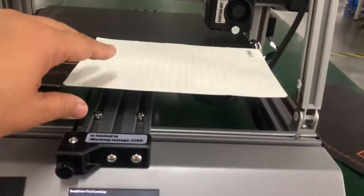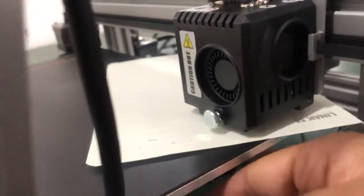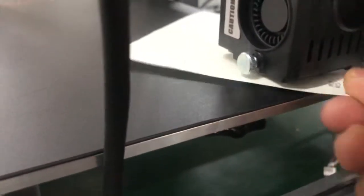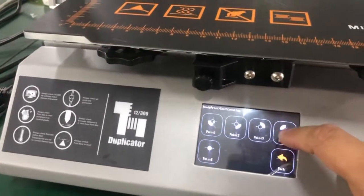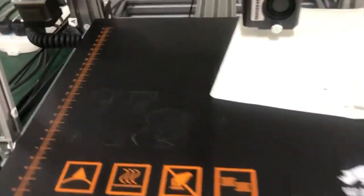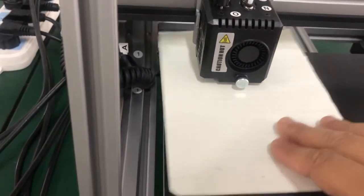The extruder will move to the third point. It's too far — we have to loosen the bolt. Now it's too tight, so turn back one or two turns. Getting close — just a little friction is what we want. You may need to repeat this procedure two or three times to ensure good leveling.